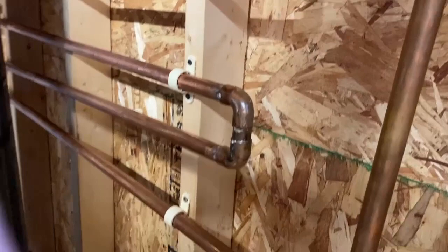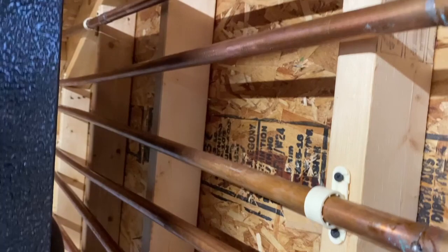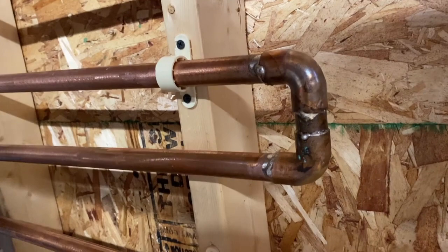I have about 50 feet of copper tubing that I just soldered together with elbows. I laid it on the ground, soldered them all square, and then as I mounted it with these cheap plastic brackets, I simply stretched it up a little bit and put a level on it. So the hot air as it travels up towards the top — as it cools, any moisture that condensates out is slowly going to trickle its way back and drop out the bottom right here where I can drain it. Eventually I'm going to plumb that through the floor down to the lower level.